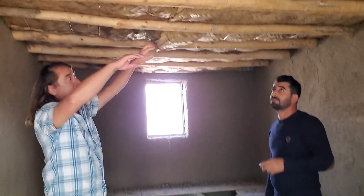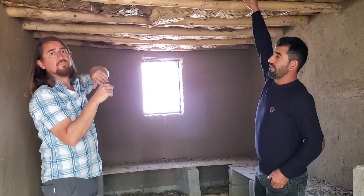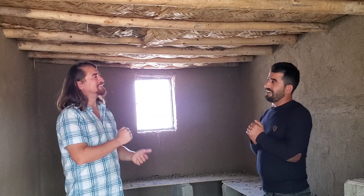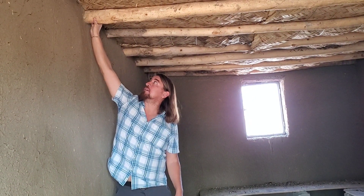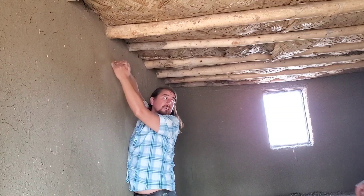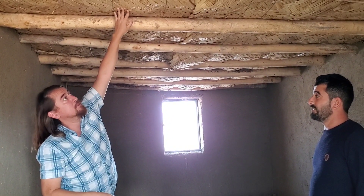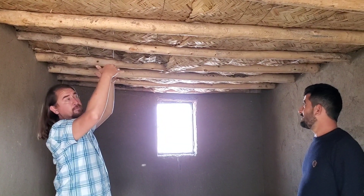So the roof is very interesting. The rafters — what kind of wood are you using? Strong wood, just bought locally. Yassar sets the rafters right onto the bricks — there's brick on each side and the rafter sits in a little hole left between them. Then he puts this thatch material, which is reeds — reeds from like a marsh or swamp — woven together as the top layer, for this style of house.